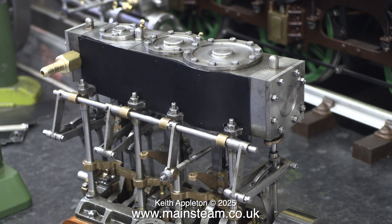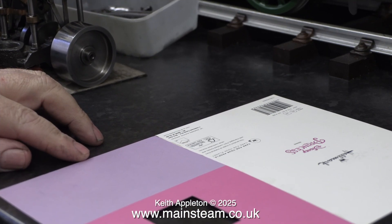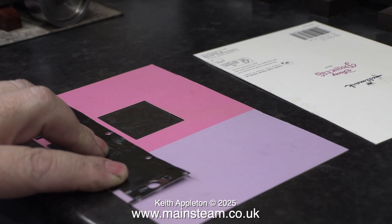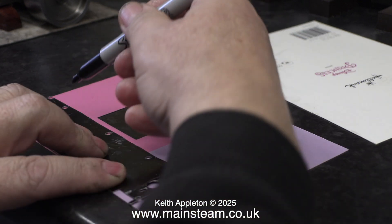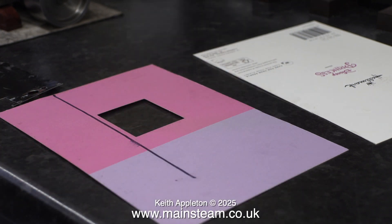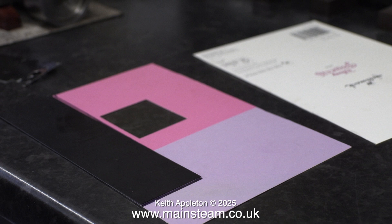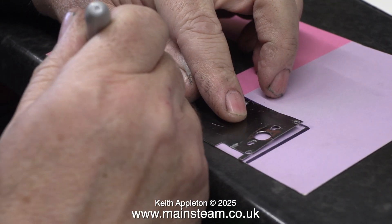This is an initial test fit of the piece of cladding to see if the slots are in the right place. Here is the original piece of cladding that was fitted to the engine - it's made from anodized aluminium, and although the anodizing is hard, the metal is soft. This old Christmas card is quite a nice color, the perfect thickness, and has the rigidity that is perfect for the job. I'm using a Sharpie felt tip pen, which is not ideal, as it will make marks not exactly right to the size of the original piece of metal. Had I used a sharp pencil the line would have been much more accurate, but I do like a margin of error - hence the Sharpie - which means I will possibly cut this a little bit oversized to start with.